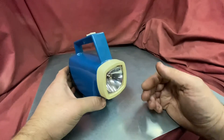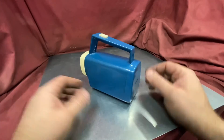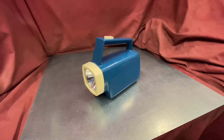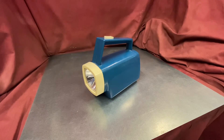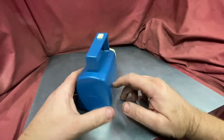In terms of a conversion, this makes old torches very much usable and also rechargeable. There's no need to throw it away - just upgrade it with a bulb, put some batteries in and away you go. I could make it easier with a charging port but it lasts so long I just don't need to. If I did this conversion again, maybe I would look at using fewer batteries - three instead of five - because you just don't need the capacity. But even with three batteries at 2000 to 3000 milliamp hours, you'd get the same or longer life. Modern technology makes these old torches very much usable once again.